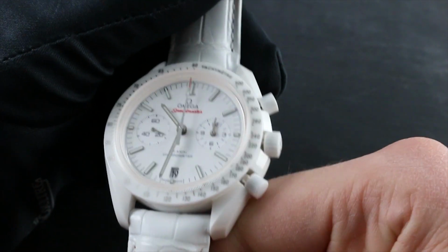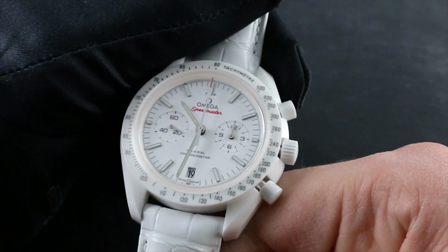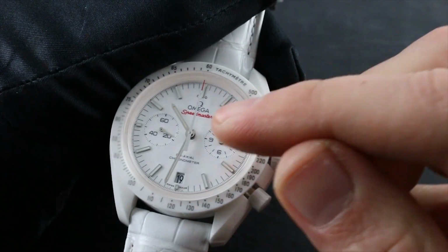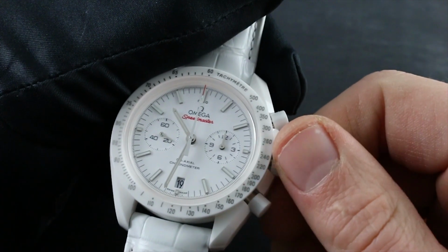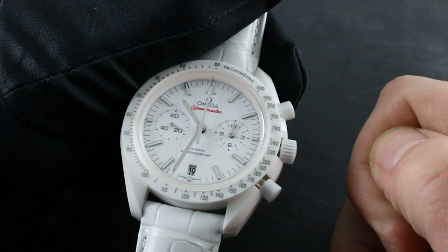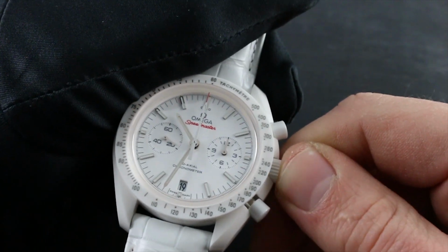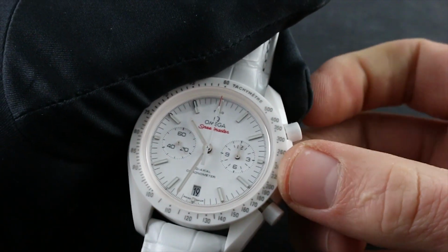This can be used to set the watch accurately against a known accurate reference time, such as an available online atomic clock. Find an online atomic clock that is set to your time zone, and then stop the seconds hand when it reaches 60. That's the best way to synchronize. Then set the same hour as the atomic clock and set the watch 1 minute ahead compared to your reference. When the reference catches up to read the same second, minute, and hour, push the crown back in, resume the beat of the balance. Now you've synchronized to a reference time.